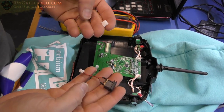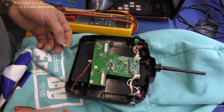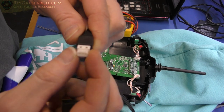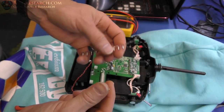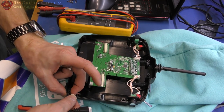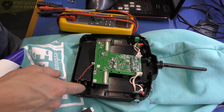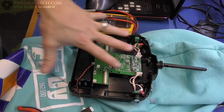All right, boys and girls — here is the plan. I don't suspect that this is a problem. That center pin goes nowhere — checked it, it's good. This light here is not really doing me any help. I popped this little module out — it's a nice little module. I have some of these plugs that are the same size as my little charger, and I have the crimp pins right here. Everything's ready to go. I'm going to crimp a little wire, solder them to each one of these pins, take this plug and let it sit out the side, hot glue it in there so I can just plug this in and unplug it. I think this is a good option because the original way was complicated due to how the power is connected. So I'm just going to leave all that alone and wire up my own little rig.